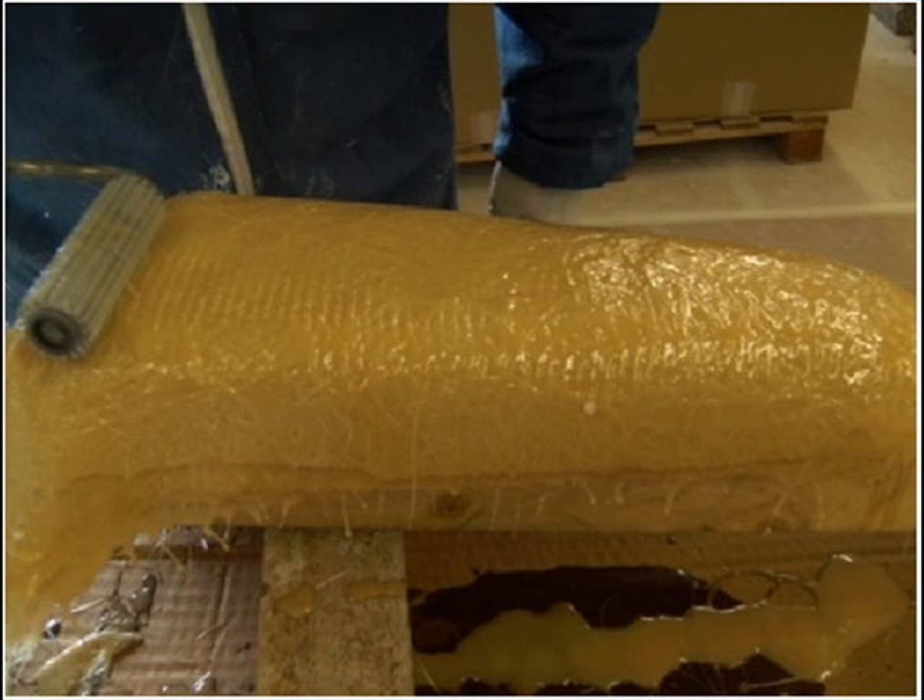The choice of resin to use is quite simple for such small parts. A general purpose resin will suffice, although the one shown in the picture is a resin called OptiMold, which has very low shrinkage — though this has to be applied all 5 layers at once. This in turn generates the exotherm needed for its curing characteristics. If using a general purpose resin, leave the mould for at least a few days to cure.